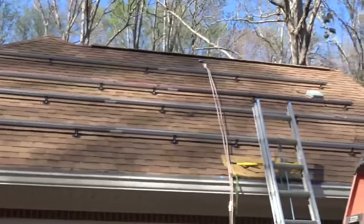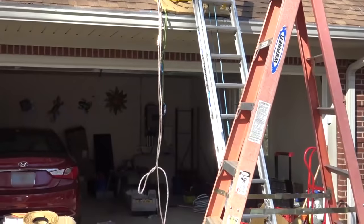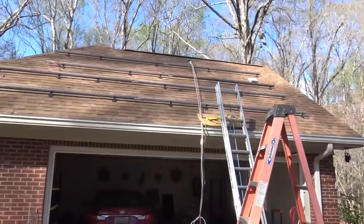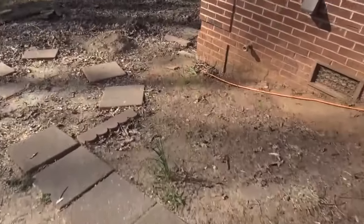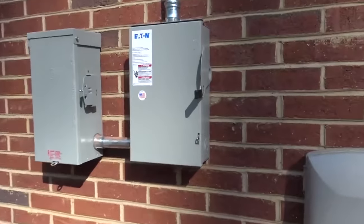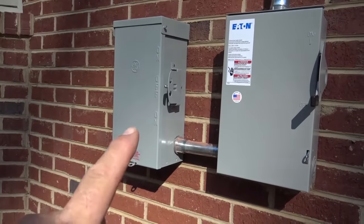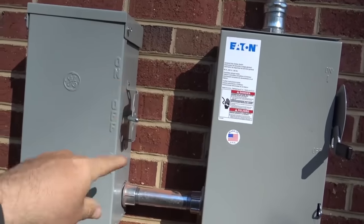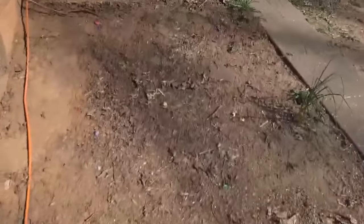The guys did a really neat job. We'll put panels up tomorrow. Then the battery bank — we'll have a pretty good dent into finishing this thing tomorrow. It'll probably be a two and a half day job. The disconnects out here — our AC disconnect is here. If the grid goes down and we want to use our portable generator to charge batteries, we can select grid or battery. We'll have a 30 amp generator input for the customer's portable generator, allowing them to charge batteries or run loads. We need a couple ground bars — pretty straightforward. You'll see the rest tomorrow.